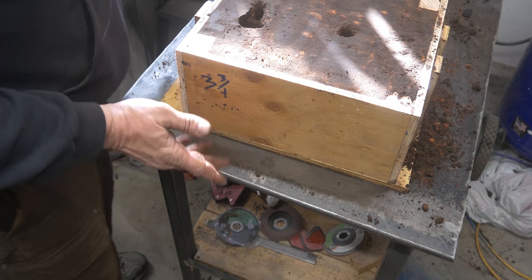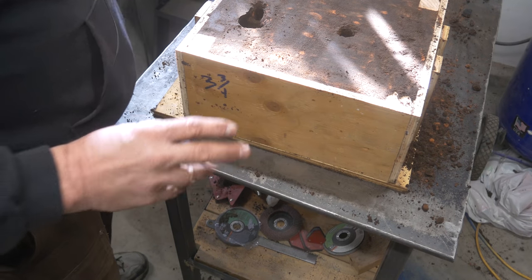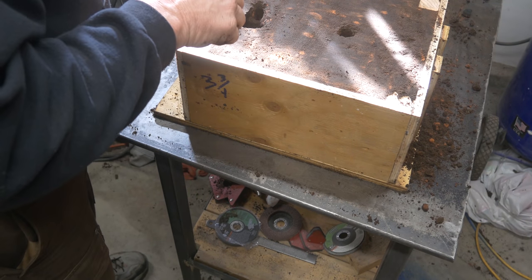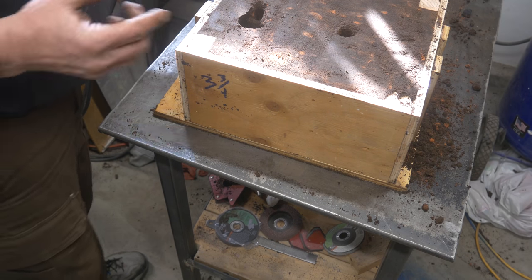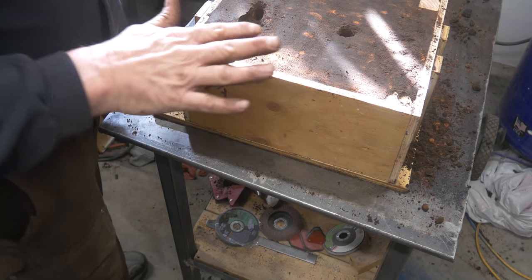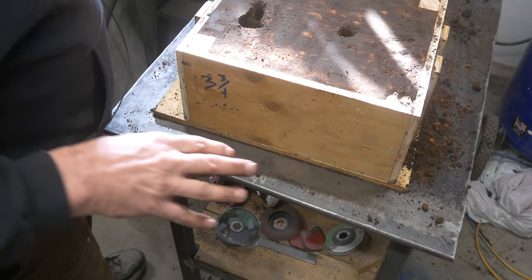I'm going to turn this thing over — just turn it over 90 degrees. I'm going to blow out the sprue and blow out that vent. I won't blow out the vent too much because the pattern is still in there, but get it cleaned out, then we'll turn it all the way over, put the drag on it upside down, and we'll ram up the inside of the bell. Before that's all done, we'll have to clean out the sprue again.